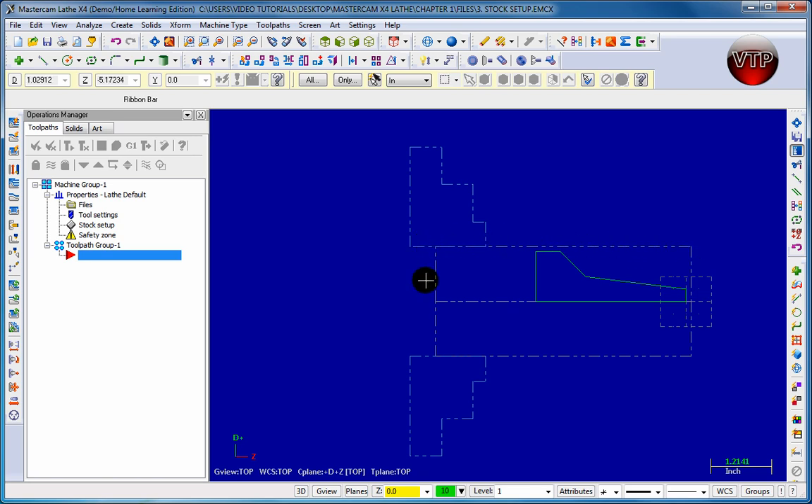Click on the check mark and there you go. In the previous session you set up your stock, and in this session you set up your chuck — so you have both set up. You can see what's happening in your part while you're machining to make sure you don't have any interferences with your tools. You have to know your tools and know your chuck, and set up the real chuck you have with the real tools. We're now concluded with the setup of the stock and chuck, and we're ready to start creating our toolpath.